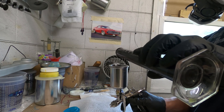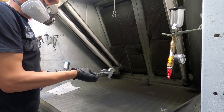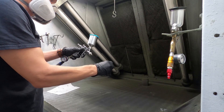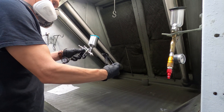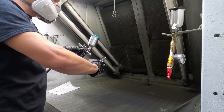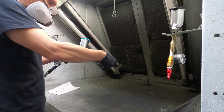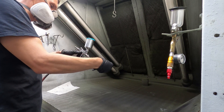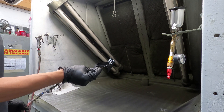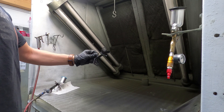Once that's done you are ready to spray your parts. Here's one of those brackets — I'm trying to get one single nice coat. You don't want to overspray it so your coating doesn't run, but you also don't want to miss any corners. You basically have to have a hundred percent nice coverage of whatever your part is. This one is not a flat part so it's a little bit tricky, but it came out really good — I liked it.